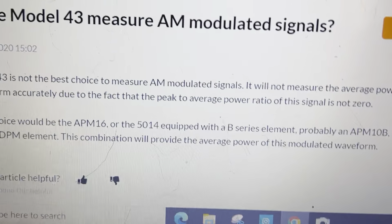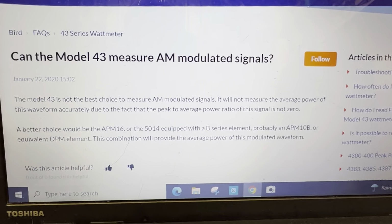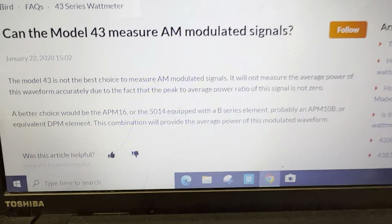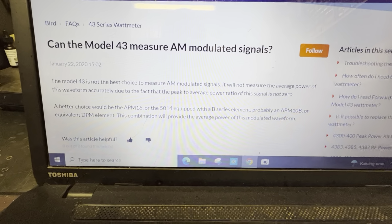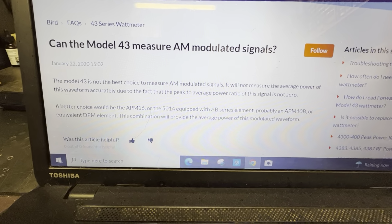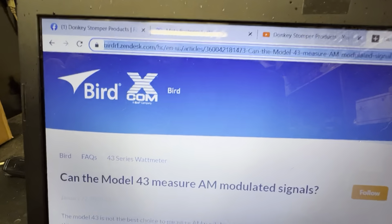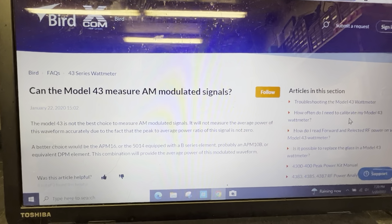Okay, guys, that's my point. The way the radio is tuned and everything, the average can be manipulated. It cannot read the average correctly besides a dead key. And it does right on dead key. But modulated, just because it says it's doing something average, like if it says that 29 is doing 1,000, average 1,100, that still does not mean it will out-talk the 2995 doing 500. Right there's the proof in the pudding. I mean, who else do you want to get it from? But, like I said, I just want to share this with everybody.